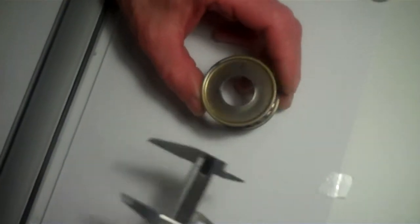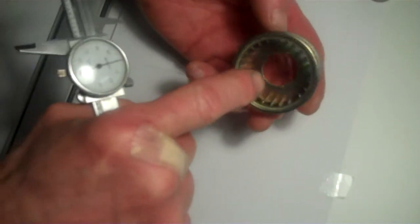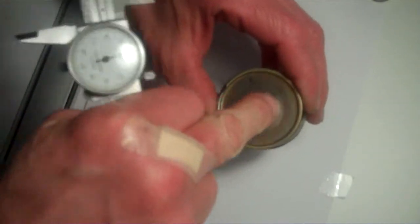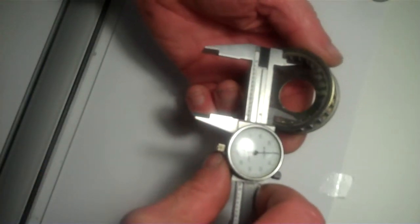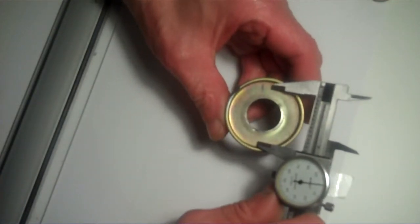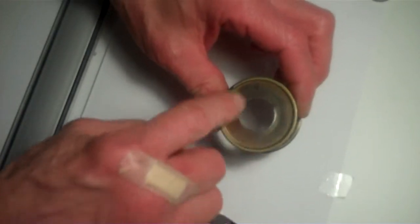Now, the next thing I need to check for is that 1 inch 400 thou. Is that going to give me enough to get rivets in there? Yes, because the flange is going to go down inside here. That's where it's going to go, and then I'll be drilling through here and pop riveting through here into the flange. So at 1 inch 400 thou, that still gives me enough to be able to get rivets in there. I have to use smaller rivets, of course, but I can still rivet that into there and have enough room around here to rivet that.